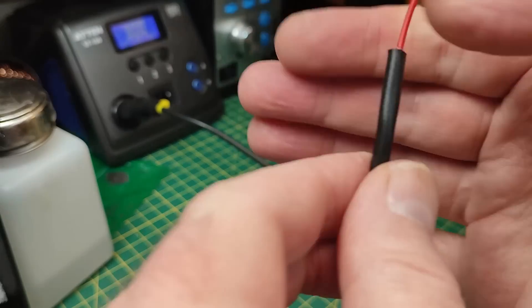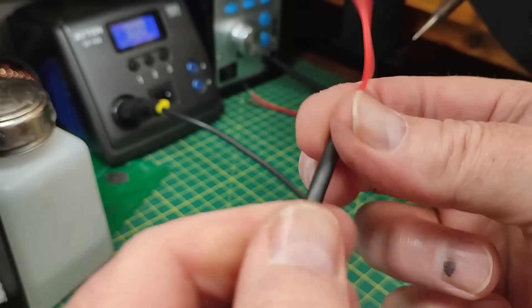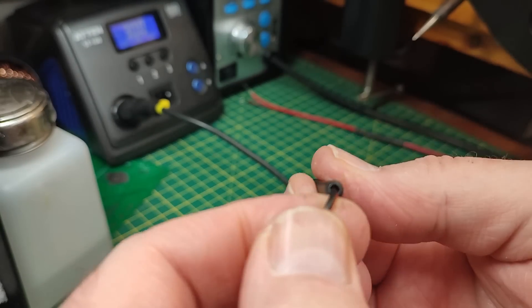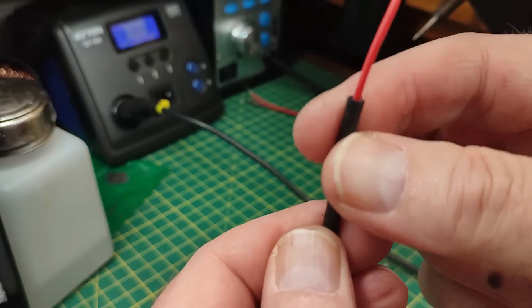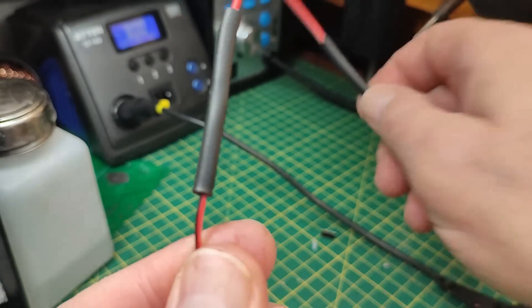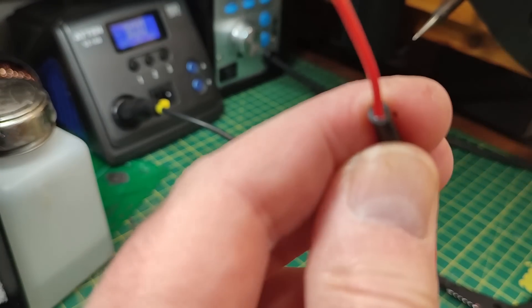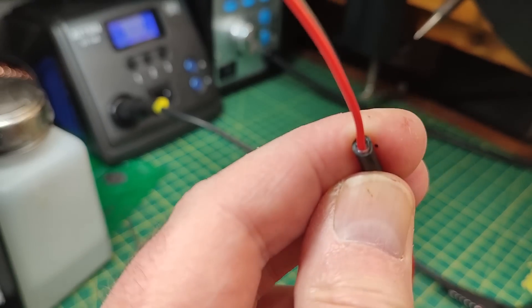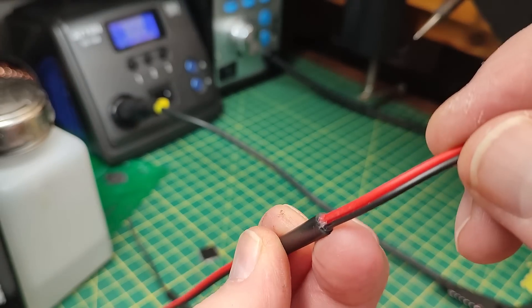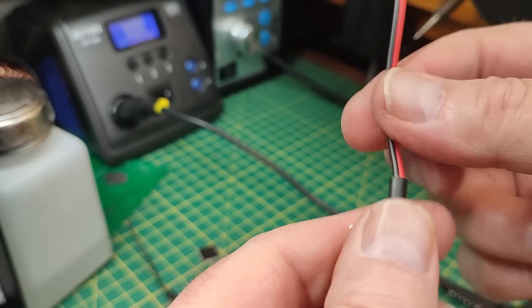Not to mention hot! That's sealed it — I can feel the stickiness, it's slowly hardening. The piece I used was probably a little too big for a single wire, but on the double-wire example over here it worked really well. You can see adhesive coming out the ends — that means it's totally waterproof and very strong because it's now bonded to the wire itself.